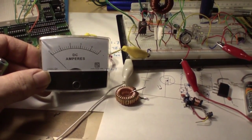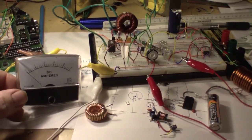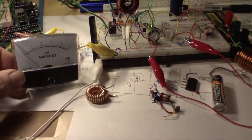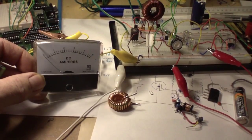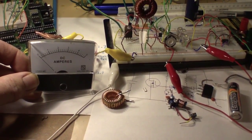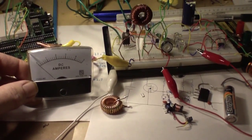The one difference I do see is that if you have a multimeter that gives you an RMS value, instead of a typical cheap multimeter — that's one of the reasons why I use analog devices — while they're not RMS, the needle I believe will level off to the RMS more accurately than a digital multimeter that's not intended to be used for pulsing loads. So you tell me.